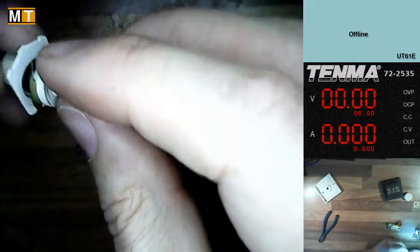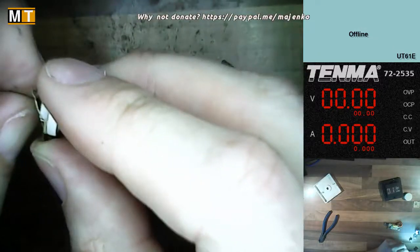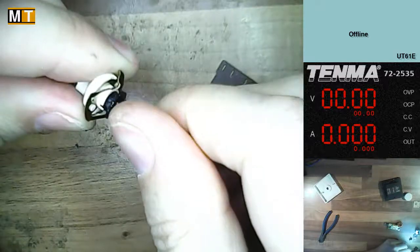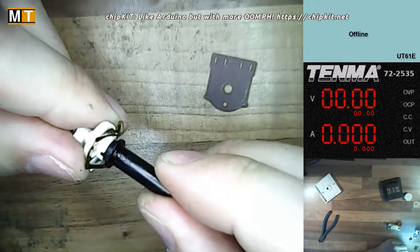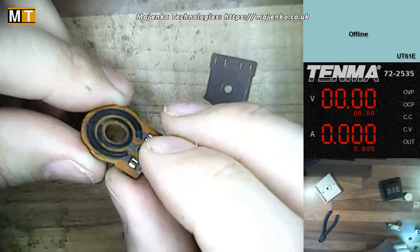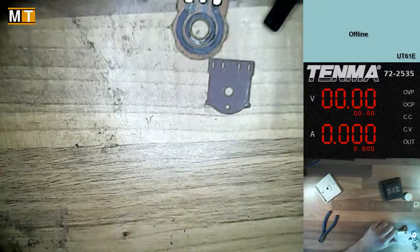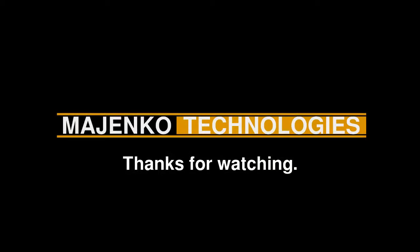The potentiometer is so old that the cam itself has completely snapped in half. I could replace the potentiometer, but I've just replaced the light bulb with an LED bulb without needing a fancy dimmable one, which often don't work anyway. I could super glue it together and restore the potentiometer, but looking at the track, the corrosion and lack of much carbon left, I think the potentiometer itself is pretty much useless. So there you go — just a quick look inside a potentiometer to see why it's failed.